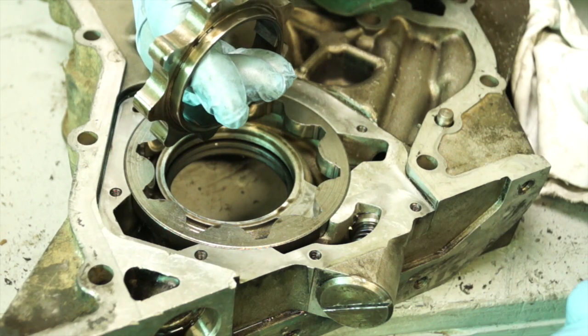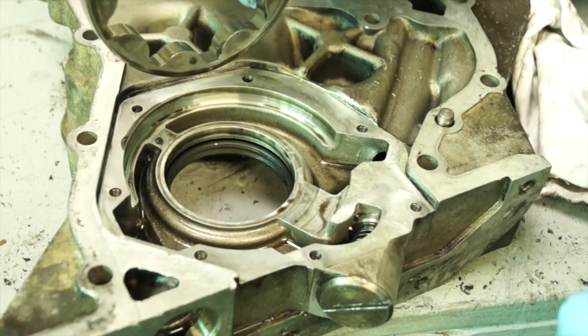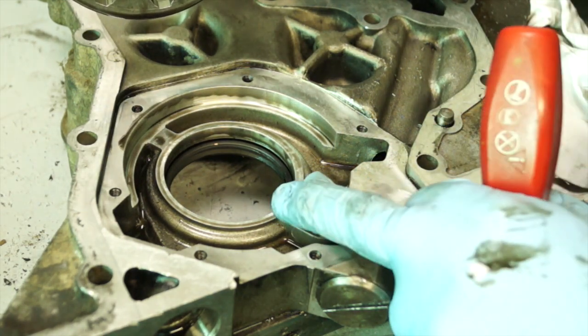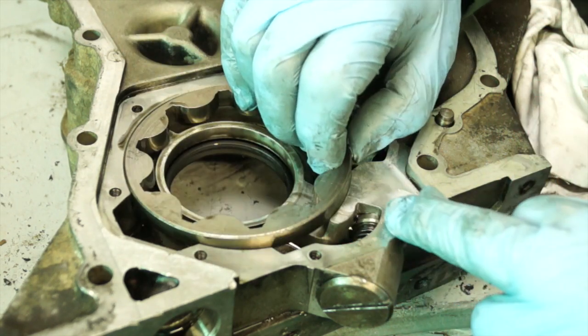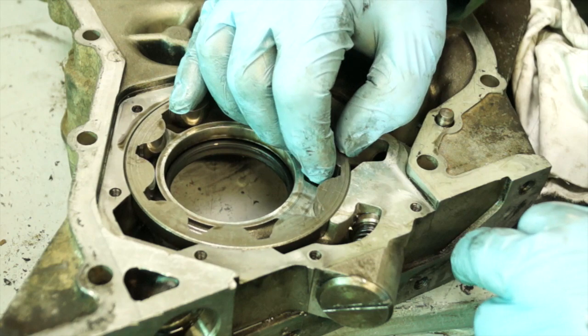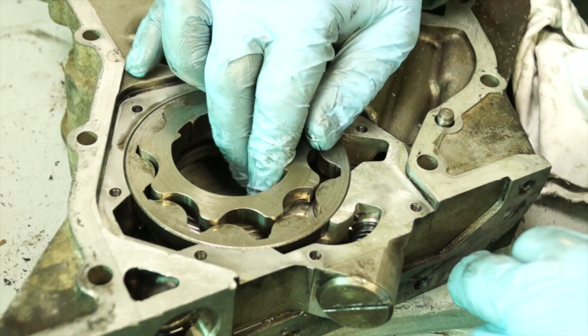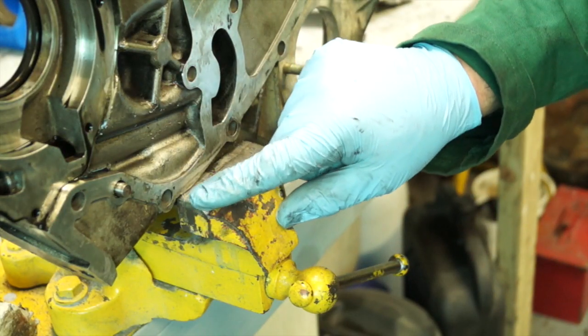You've got to make sure that when you put them back together they fit in exactly the same place, if the rotors are in good condition — but we've got to check them first. Dismantling them, we can check the condition to see if there's any scoring. If there's bad scoring then the pump would probably be scrapped along with the housing itself. We're going to do some measurements on these — it's vital to check the condition of the pump as this will determine how much money we're going to spend.